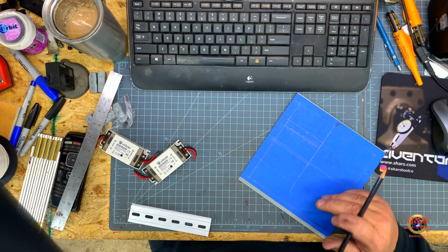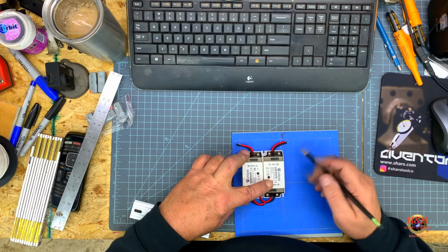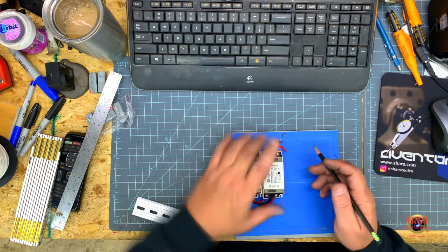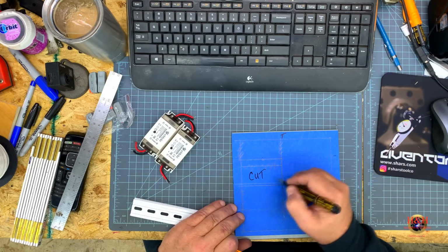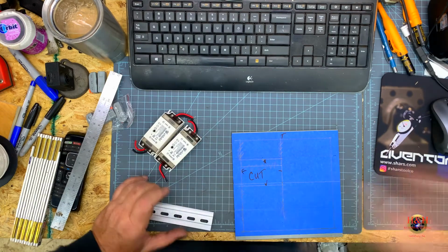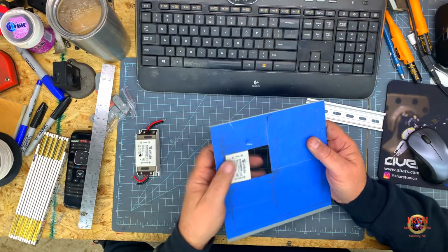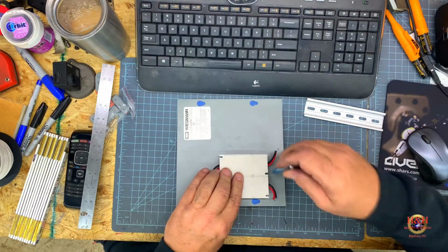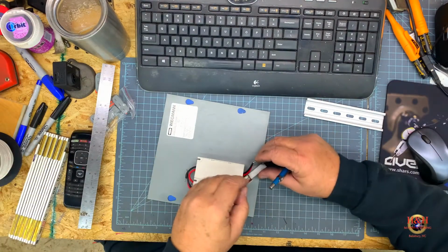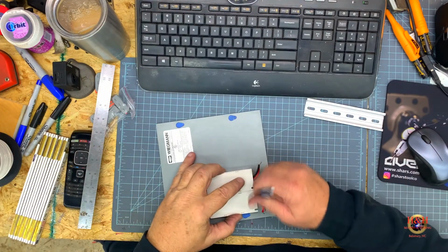The back shop actually has the amp meter in it, and the front one I may put something different in it. I was worried I wouldn't have enough space having two relays in it. It's 2 relays and one contactor in this box. So I was worried about a little space there. So now we got everything fitted in. I cut it just shy of what I needed to use, and then I used a file to get the shape correct.